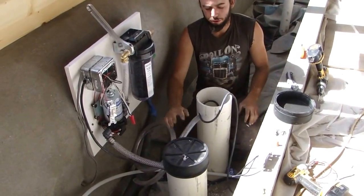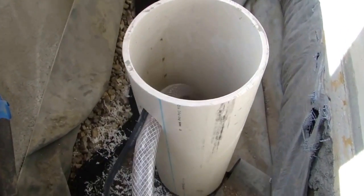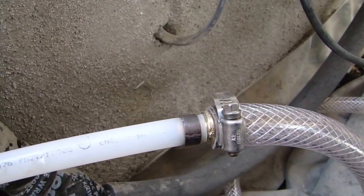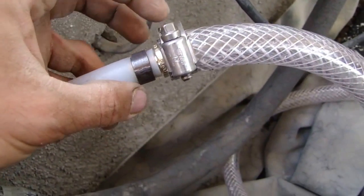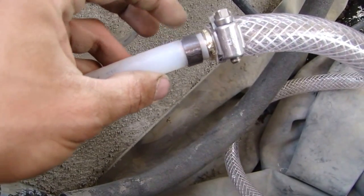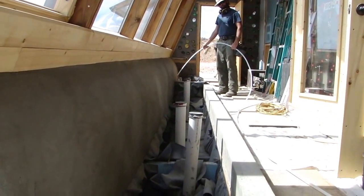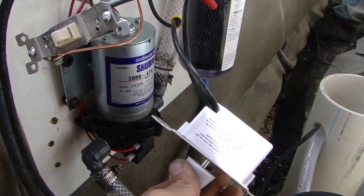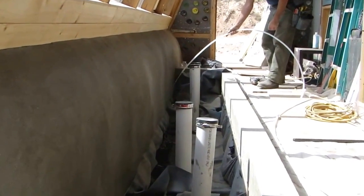Now I'm going to make my hose connections and electrical connections in the box where I already have DC power run. The submersible pump for the recirculation is all done inside. I connected the hose using a three-quarter-inch to half-inch PEX brass fitting — I clamped the three-quarter-inch inside-dimension hose to the PEX crimp side of the fitting. There's a half-inch PEX crimp on the other side and that PEX hose goes all the way down into the planter to the reception cell. I have the 60-minute timer wired up — I'll turn it on and you can hear it running and there goes the water.